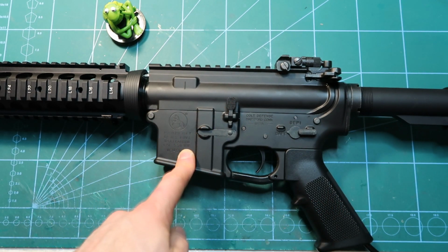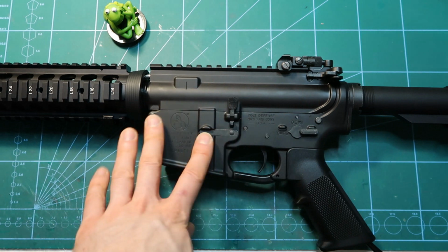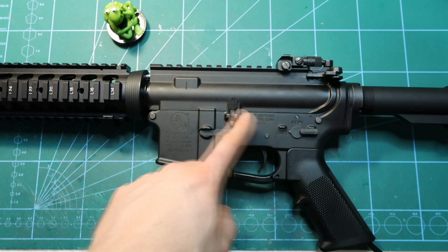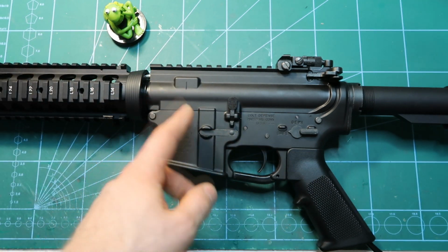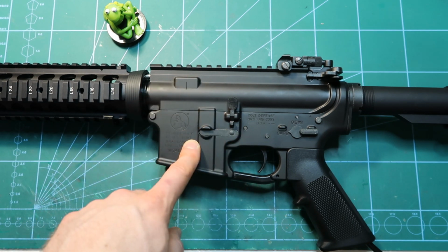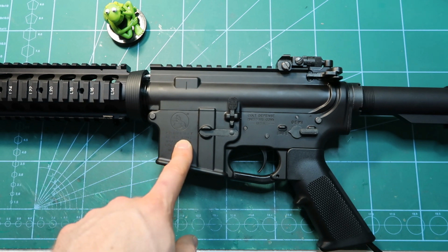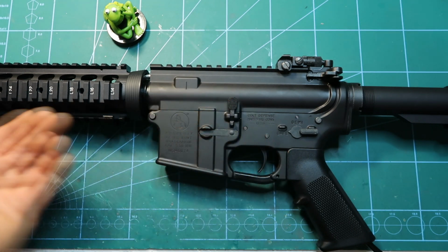One thing, also a potential issue I had in one of the guns, I call it the dry farting. What happens is that in this test everything's fine, but then you connect pressure and the resistance from the pressure and the valve and the return spring in the valve knocker is too big, and the valve cannot be pushed into a position to shoot. So how do you recognize it? As I said, right now function is okay, and when you connect the pressure, the function will be either not shooting at all because nothing will happen, the hammer will be released but it will not have enough strength to push on the valve, or what could happen is like a fart, so the gun would do tss, tss, tss only and not shoot.